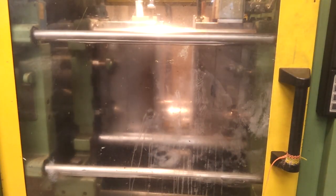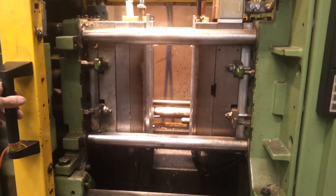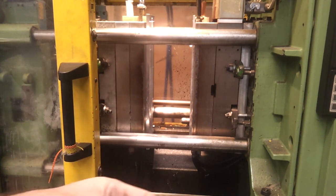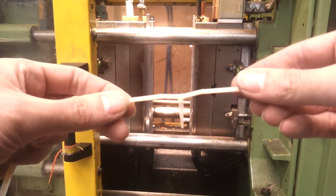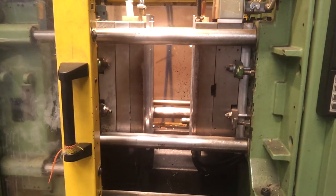I now have two grab pins at the bottom and two grab pins at the top, and with a bit of luck this should pull everything across onto the moving half. And it has — I can still get it out but it is actually working. You can see how that's pulled that sprue and pulled that sprue. It seems to be working — looks like you just need more pins.